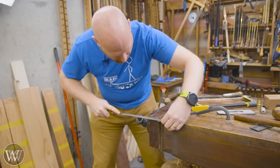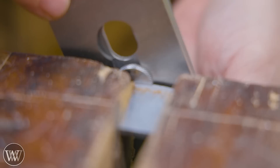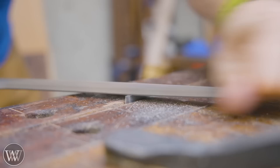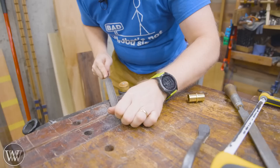After cleaning off the burr, I'm going to bring in a file and use the side of the bench as a guide to hold the file in place. I'm just going to file off the tip on both sides to bring it down to the thickness that will fit into the screw slot. Occasionally I'll bring the screw over and make sure it fits. I'm going to do the same filing to both sides — this still gives you the strength of the full thickness but it'll be much thinner to fit into the slot.